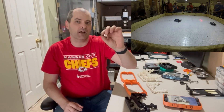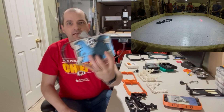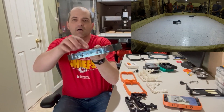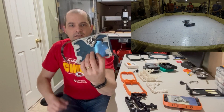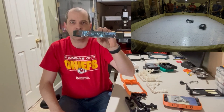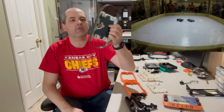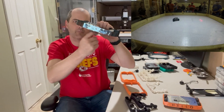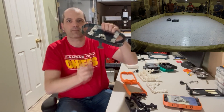I'm using N20 motors for all of these. Originally I used this size brushless motor and did a direct drive for the weapon. I had an aluminum hub that would push over the top of the motor and attach to it, with a mount on top. One of the problems was getting the blade to stay level — my goal was to get the undercutter as low as possible, so the heads of the bolts were scraping the floor a lot.